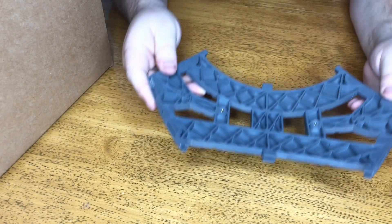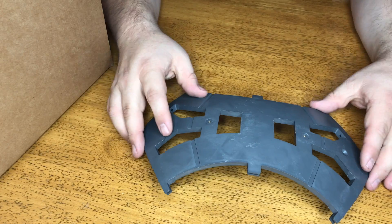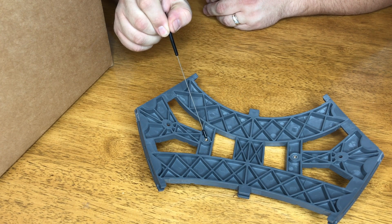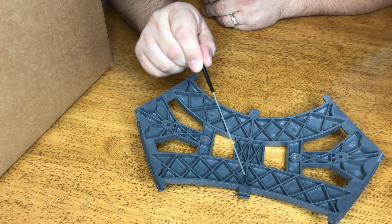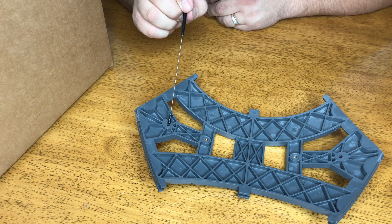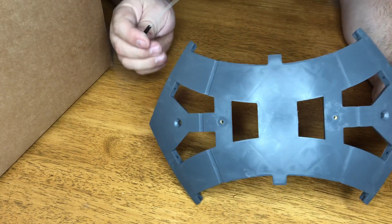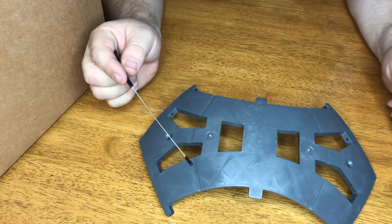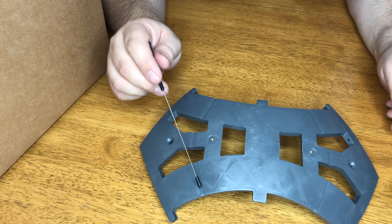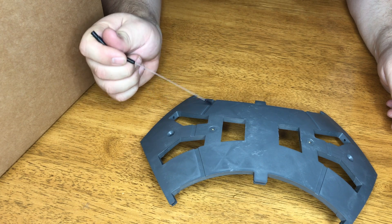Here is the Carrie Christie frame — I'll have everything linked below. As you can see, it's injection molded. There are a few details I'll point out using BB-8's antenna. You have the panel mounting holes right here, the mounts for your ribs right here, and this is where you would mount your drivetrain. The channels here are for servo wires for your NeoPixels that go inside of your panels, so this is how you'd wire up for your NeoPixels through these.